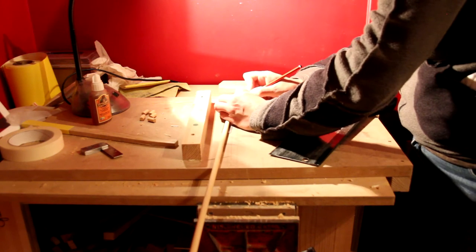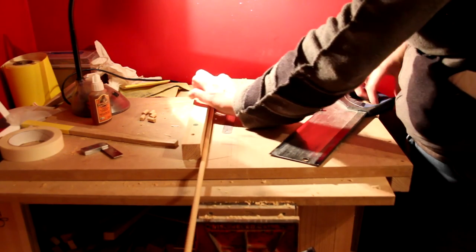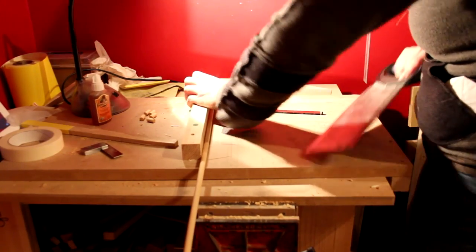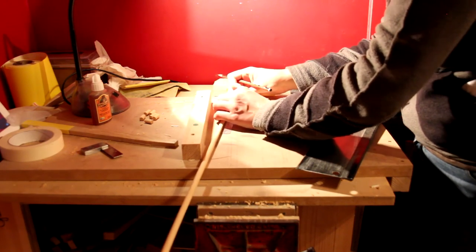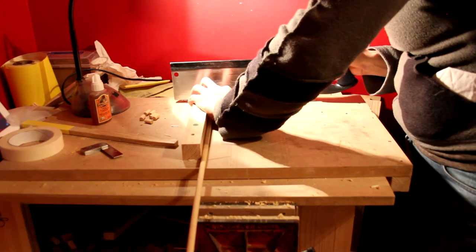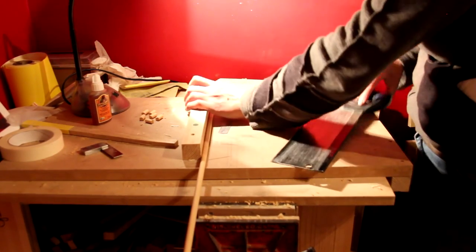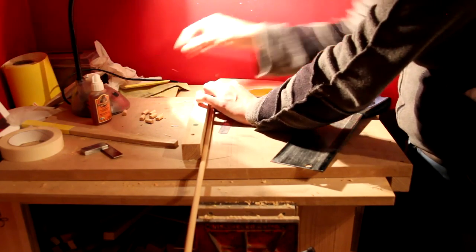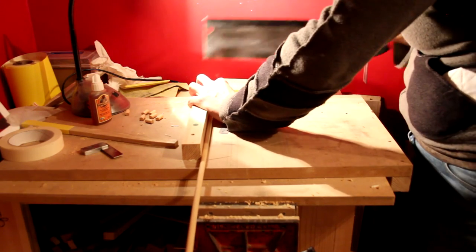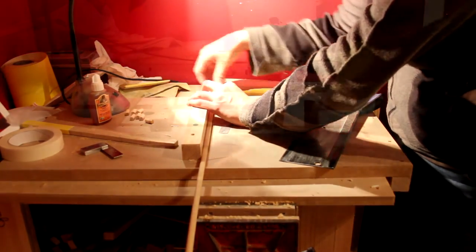Then I can cut my lengths of dowel. I think I went about 9mm into each bit of timber with the drill bit, and so my dowel pieces are just under 18mm, leaving a little bit of space for the glue. I wanted the dowel reinforcement because the glue should be strong enough, but just in case there are any extra forces on it.